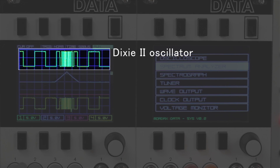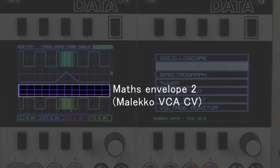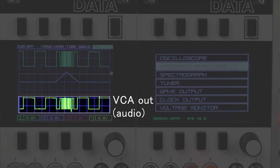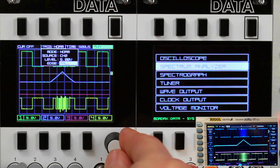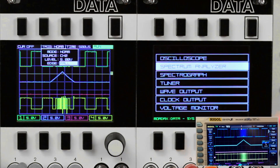One of the really useful things about having a 4-channel oscilloscope is the ability to see a complex CV and audio control pathway. For example, let's look at a square wave from the Dixie 2 that has its frequency CV control coming from one side of a Make Noise Maths AD envelope, with the other side of the Maths AD envelope controlling the amplitude of the oscillator via a Moloko VCA. The last channel of the scope is the VCA's output — the final audio that you hear. So we're triggering off of channel 2 on the scope, the rising edge. Let's switch that to falling. Now let's do the same on the Rigel — you'll notice the same shift in the waveform.